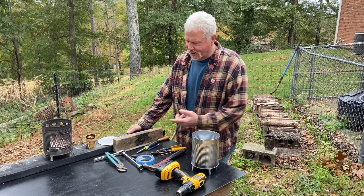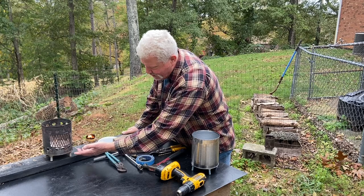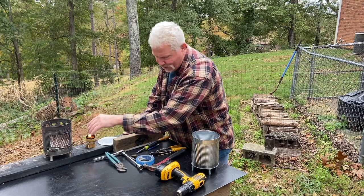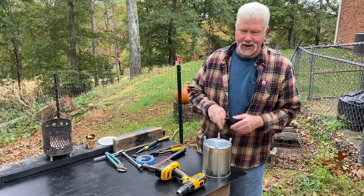All right, the center line is for the bottom row of 3/4 inch vent holes, and then one ridge up from there, the center line for the screws that support the elevated floor, and then the center line for these upper vent holes. So the upper vent holes, we're just going to center on that first ridge. You see the corrugations here?